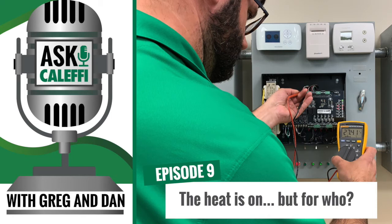If you're convinced it's the board causing the problem, once you get everything disconnected, ideally you'd want a meter and go through and check your voltages at your thermostats, check your pumps, check your actuators — your motor terminals — for voltage. But you can make a simple jumper wire and run the board through its paces. Jump out R and W at the thermostat, see if the light comes on and it calls on a pump relay. See if you get 120 volts at those pump terminals. If you have a valve relay, look for 24 volts at the motor terminals. Then to verify that part works, typically you're going to see a light on only when the end switch is made. So you need an end switch or a jumper wire to jump out the end switch terminals of the board to verify. It'll close the XX terminals for the boiler — that's just a dry contact — and then it'll also send 120 volts to the system pump.